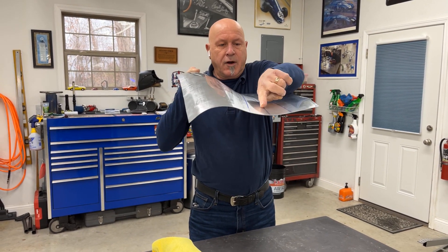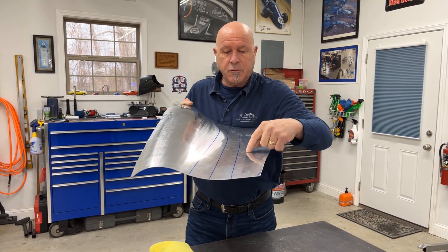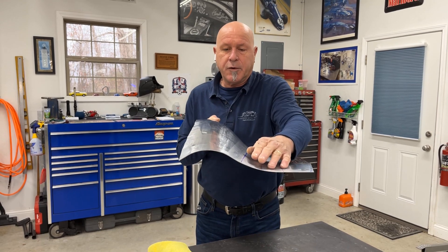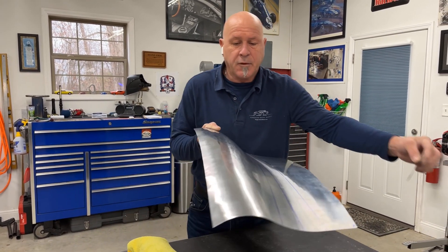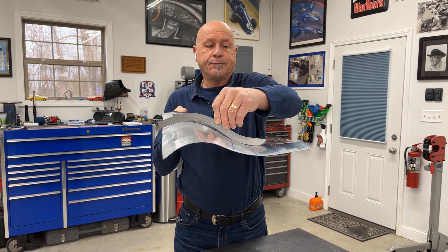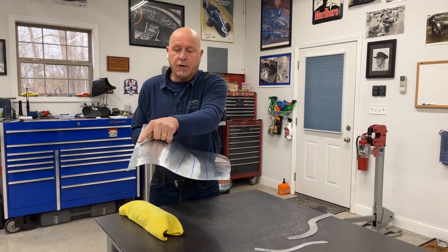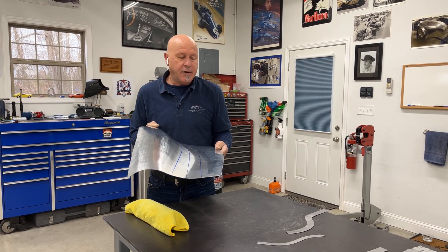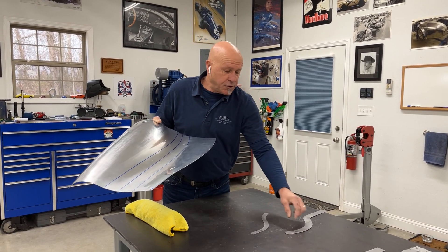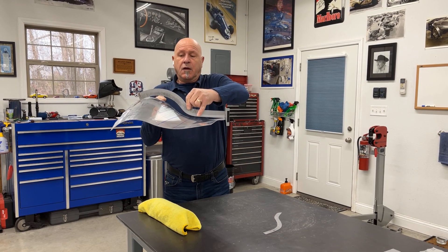You can see now I've deepened it considerably - it's coming through and it's become a curve that's relatively flat. So now I'm coming back into my third stage - I'm going to stretch some material through here to give this a little bit of a throw-over, which will transfer into this giving it a little bit of a transfer. Let's try our sweep to see where we're at. As you can see we are starting to get closer and closer. I'll probably make up another little sweep on the next video so I've got one that goes continuous all the way across.